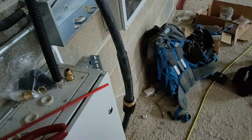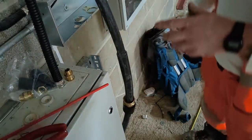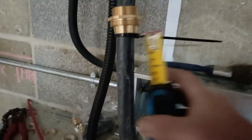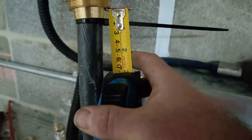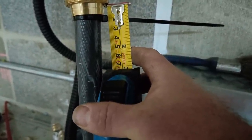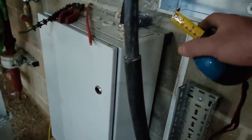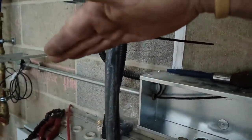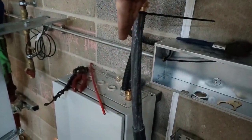That just keeps that out of the way. Now, what you need is a 40mm gland. So although this, there we are, let's have a look. So that is what, 10mm, 15mm, 12mm or something like that. So you're sort of going to need about double that in order for the armouring to be able to spread enough to accommodate the cone without the armouring being at an angle like that, sticking out far too much. It needs to be able to just sit inside of it.